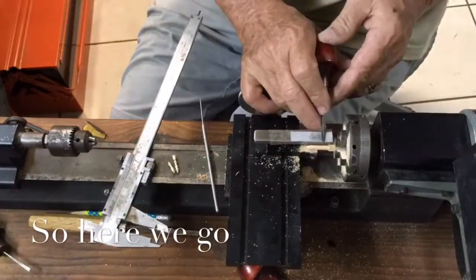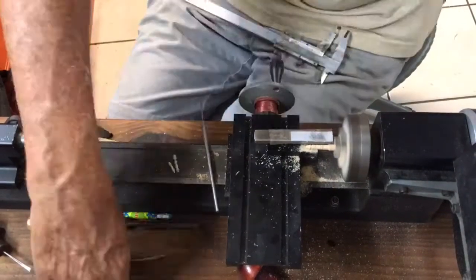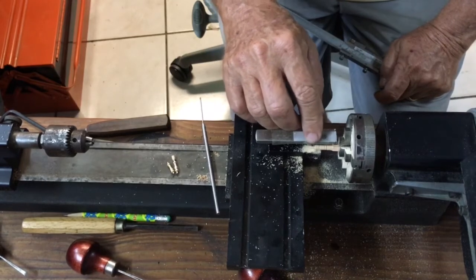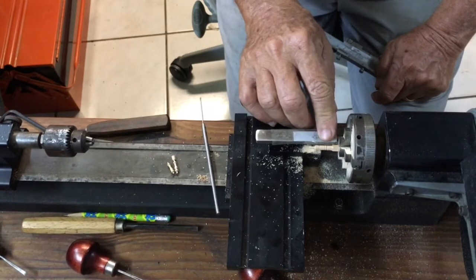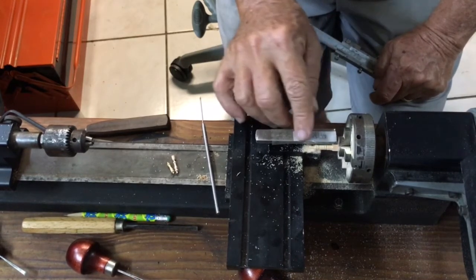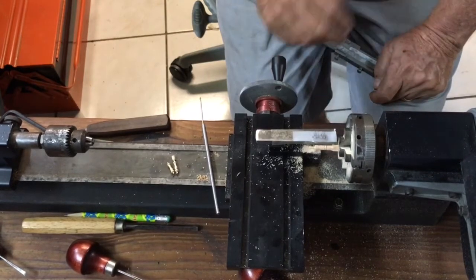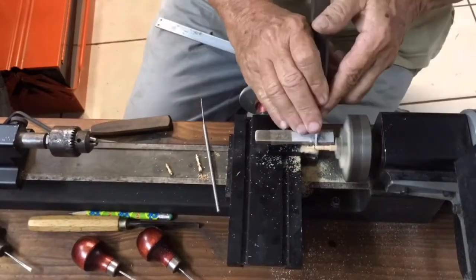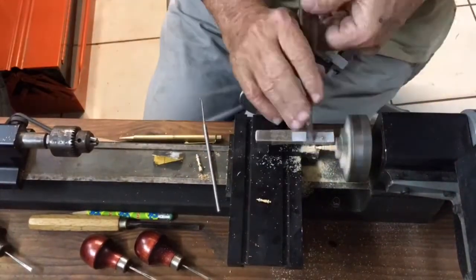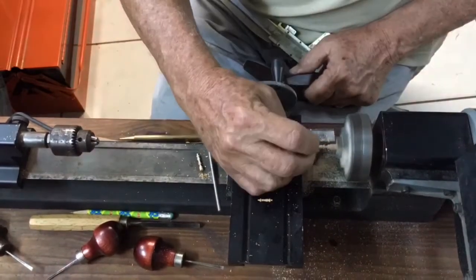The first job is to roughly take the piece down to just above the maximum width we want to end up with. Then we use one of the finest gouges to mark the key spots, doing the end to the final dimension first — because as you start to cut the balustrade and these parts get weakened, it gets much harder. So we're working from this side coming in, simply because the strength of the piece is closer to the head of the lathe. The golden rule is less is more. There's no rush — it's a very, very delicate touch.